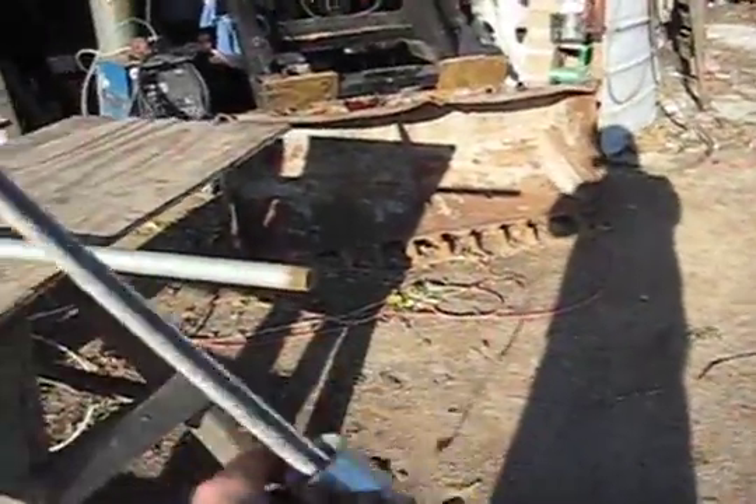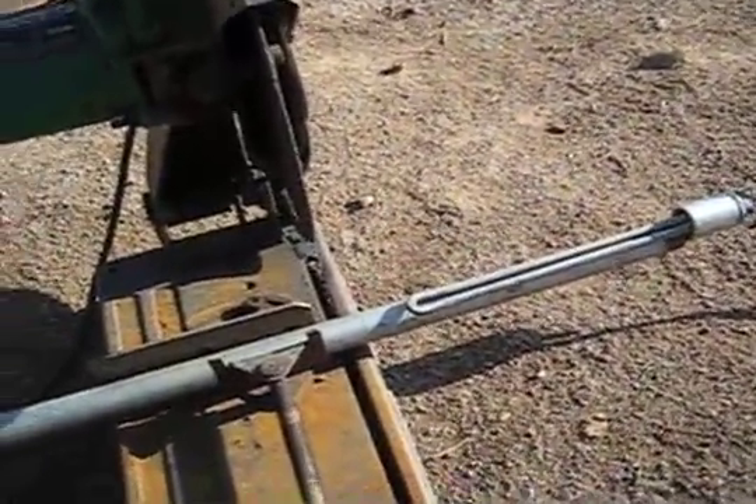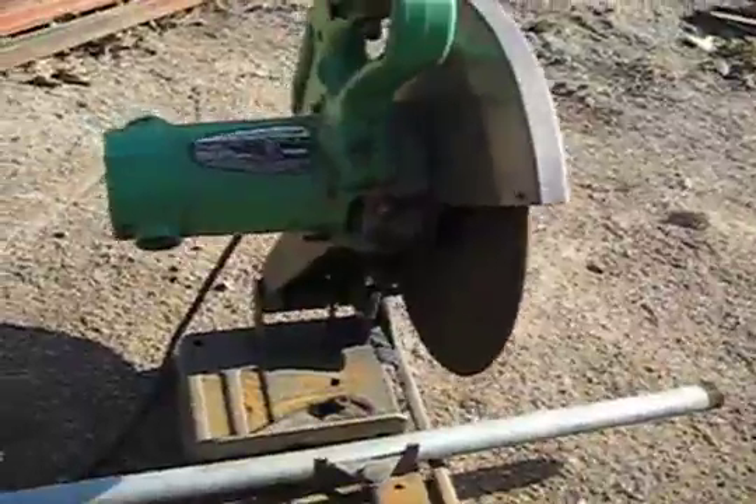Here's the DIY shower, hot on-demand shower in the making. It's just a heater element plugged into a one-inch fitting, because the heater element has a one-inch fitting on it already. Just connect it up to a power cord and it puts out about a kilowatt of power. Measure the pipe to about just a little longer than the heater element itself and cut.